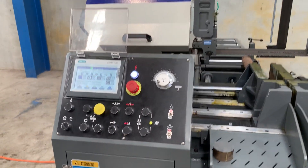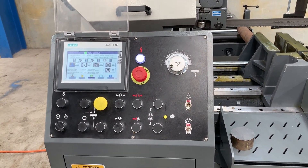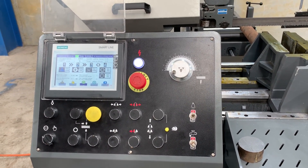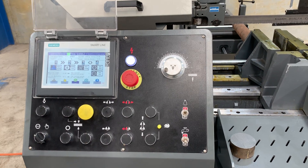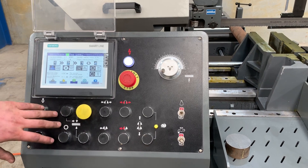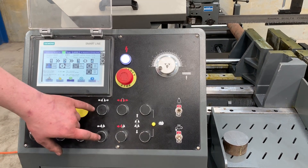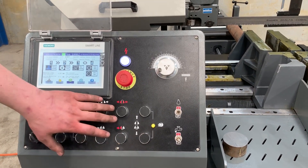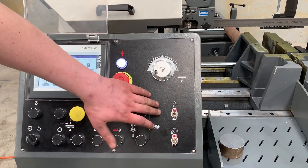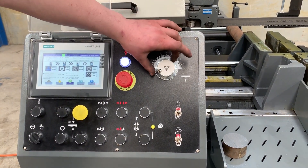As Dave mentioned, you have access to both manual and automatic controls. You can do your cutting however you like — automatic is easier for repetitive actions, while manual is for when you just need to quickly cut something. We've got access to all axes: sawing up and down, both front and rear vices locking and unlocking, feed, coolant pump, a work light for visibility, and most importantly the feed rate control at the top.